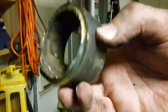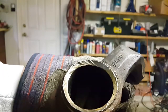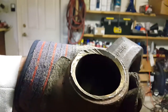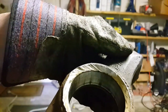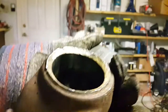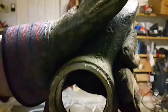I ended up welding on the inside here to shrink this a little bit. You can see the action I took with the angle grinder — just turning it around to create a kind of crater in there, then turning it until a very slight crack appeared. That seemed to be the only way to get enough of the weld out. This weld is very, very deep — you can see how undercut it is, they've welded with an enormous amount of penetration. Even then it wouldn't come out and was actually slightly distorting my 20-ton press, but after welding on the inside I managed to get it out.